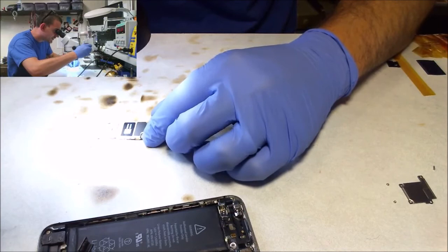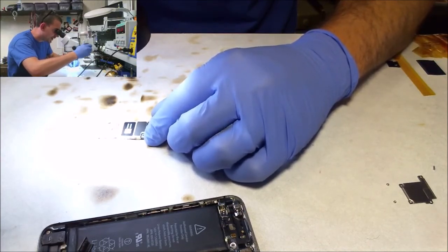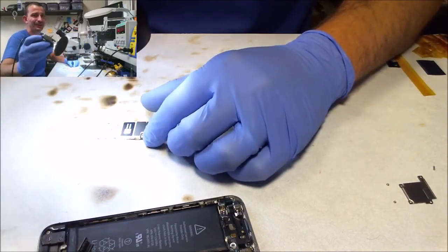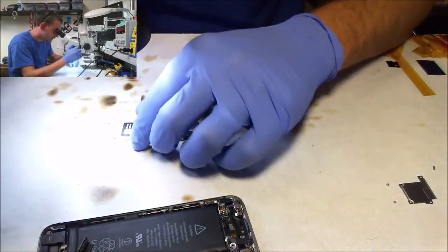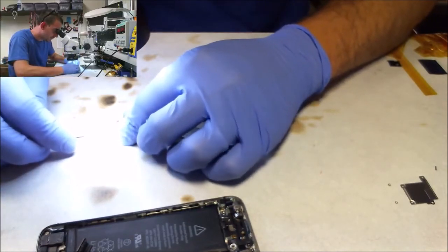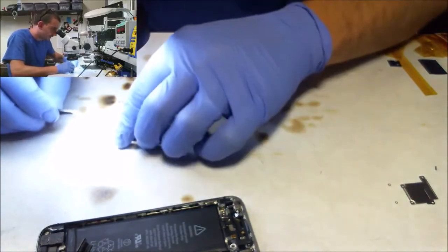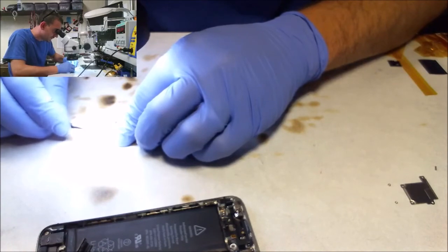Oh yeah, that solder joint that looks crappy under that USB microscope, it is actually a blob of burnt flux on top of the solder. So that's where the color that comes out of these things is deceiving. Okay, I should have peeled the little water damage indicator out of the way before I burnt it with hot air, because it needed to go anyway for ultrasonic cleaning, otherwise it's just going to come out red, or some variant of red.